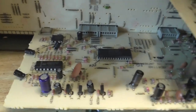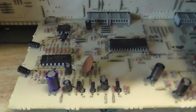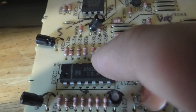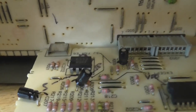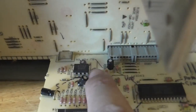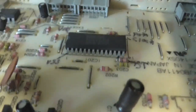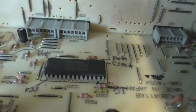It's time to see if these three chips are getting power. This one here is a quad op-amp — quite simple. We've got our power pins right in the middle: there's our positive supply, and on the other side is where our negative supply goes. This one that looks like it could be an op-amp is actually a MOSFET — the strangest MOSFET I've ever seen. These three pins are our source, this one on the end is our gate, and all the ones on the other side are the drain. And this one here appears to be the one that's actually switching the audio signal. I've marked the VSS and VDD. We've also got strobe interrupts, data, and clock to measure.